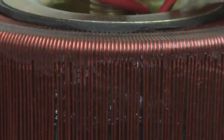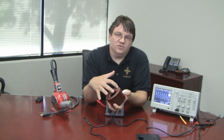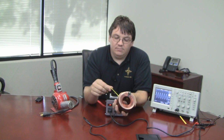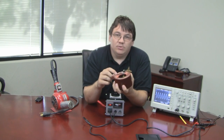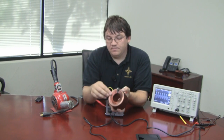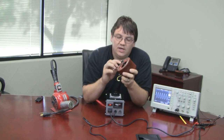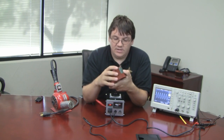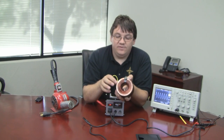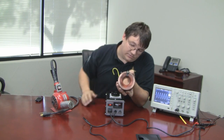If you go here with a reference to neutral and go up a couple of turns, you could get two volts AC out of this. You could go all the way around and line it up with the same wrap that the input is on and get the same voltage you're inputting — so 120 volts in, 120 volts out. Continue past that to the other end of this core specifically, and you can get it all the way to 140 volts, because the magnetic field is actually influencing the voltage on that latter half of the coil.